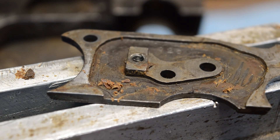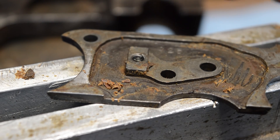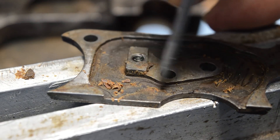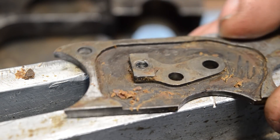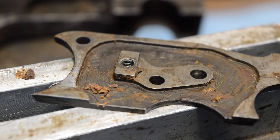You have a milling machine and it's set up to run one evolution. You may have a milling machine that does nothing but cut this down square or rectangular. Then you have another milling machine that makes this cut. So you've got a box of these parts moving down the line and every single one of those machines is doing one thing. One guy doesn't sit down and bang this whole side plate out because he makes one mistake. You don't depend upon the human to etch-a-sketch the handles the right way.